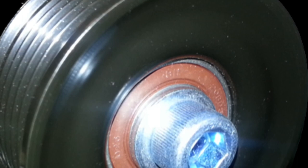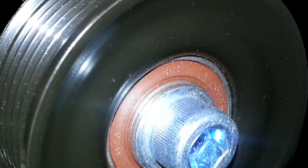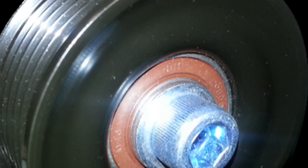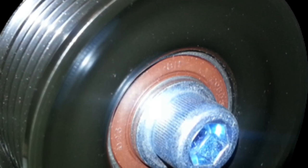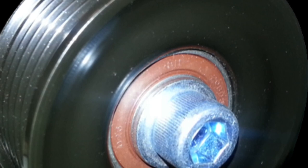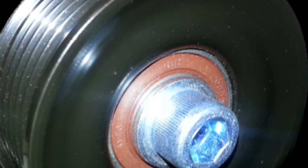The alternator is securely mounted on this engine, except for a few models where only a single mounting ear is locating the alternator on the top mount. If this is the case, there is a part that bolts to the engine to increase the strength by adding a mounting ear, for a dual mounting ear on top and a single on the bottom.